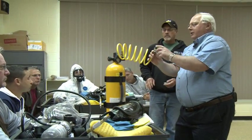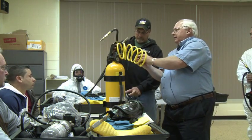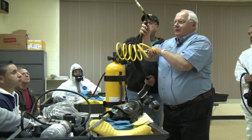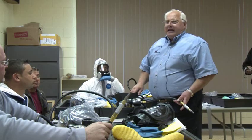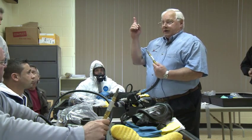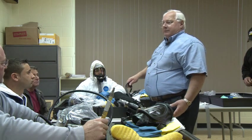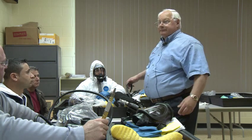Okay, this is your bottled air. I pull this back, Al wants to plug in, he plugs in. We're going to say that's our bottle — we're plugged in. This is going to be for the machine air. The reason they make this 15 inches is so that if I can't see, I can bring this up here and plug in and check it to the hose on the machine, and I physically can see it. If I need to exit, I take that, I turn it, I leave it in the machine, I let go of this, I'm still hooked up to my other one, I grab my bottle, I exit the machine. No muss, no fuss.